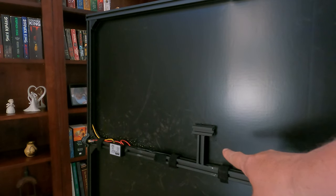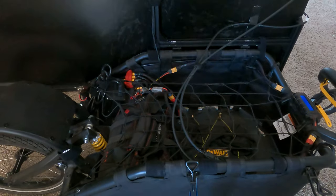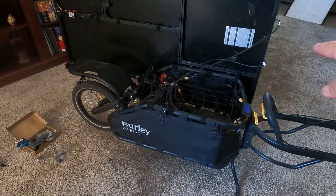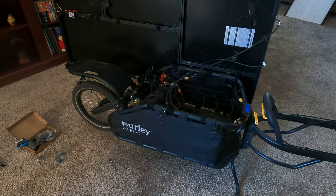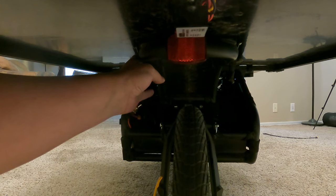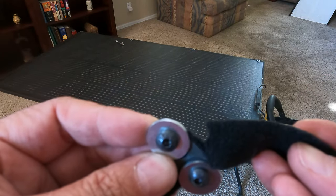After today's ride I found the connection between the panel and the back bumper was flexing back and forth repeatedly until the Velcro broke — Velcro has its limits once enough of the strings break, it just doesn't stick anymore. I'm adding a latch design like the one up front, plus one more hinge, aiming for three latches on one side and three hinges on the other. I also ended up adding another clamp on the back side of the fender to keep it from wobbling, bringing the total to four Velcro points as a prototype — though some was already ripping after just a few short city miles.